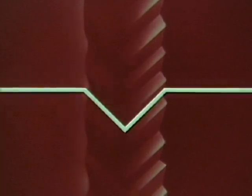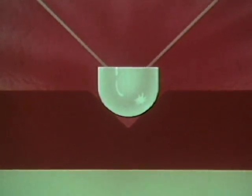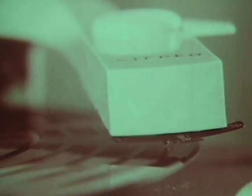Now let's take another look at our living stereo record groove with its two separate soundtrack impressions, one on each side. In cross section, it looks like this: a V-shaped groove, 45 degrees on each side. As the record turns, the right side of the groove reproduces the sound from the left-hand section of the orchestra, and the left side reproduces the sound from the right-hand section. Two totally different soundtracks coming from one groove, on one record, with one stylus. This is living stereo.